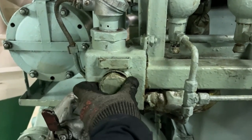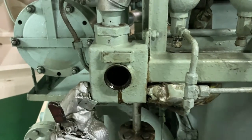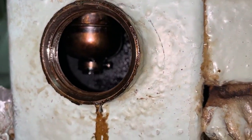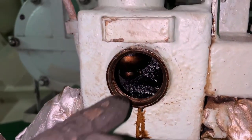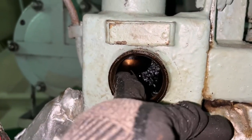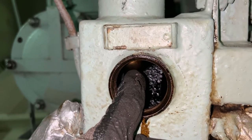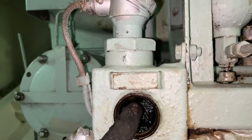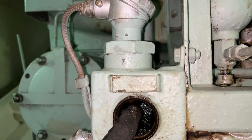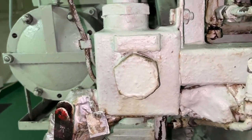This is your fuel leak-off port. You have to open this nut and you can see there is a float. You just need to lift that float to activate the fuel leak-off alarm. I have lifted it up, and based on the timer setting — it can be 20 seconds or 10 seconds — your fuel leak-off alarm will be activated. This is very simple. Once you are done, close it and we will move ahead.